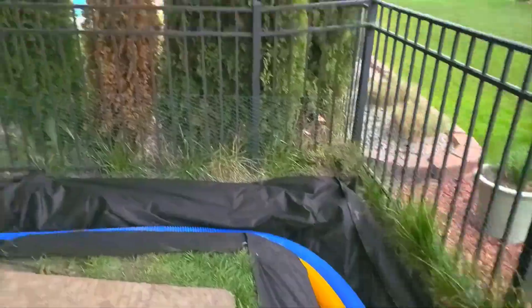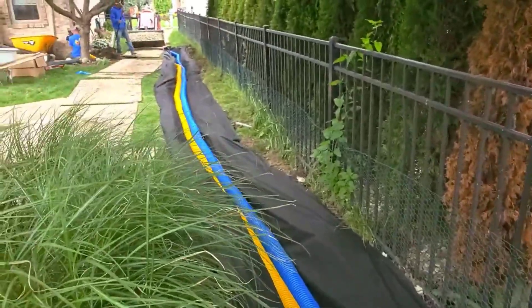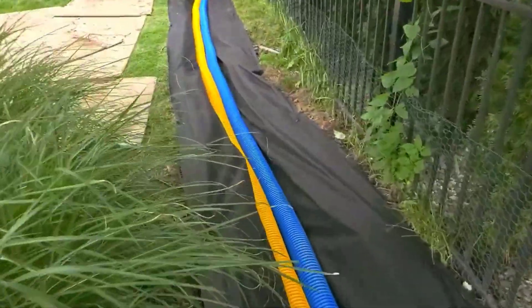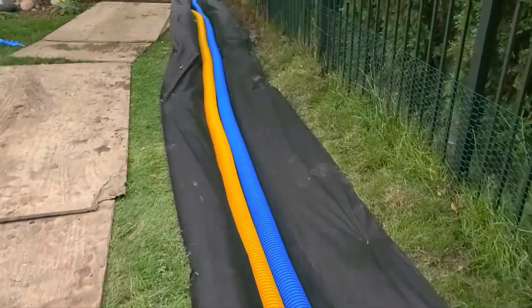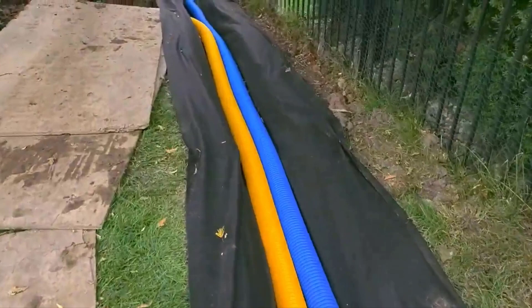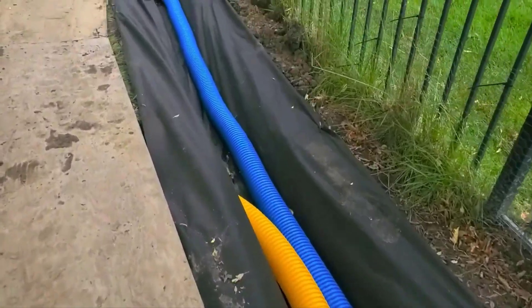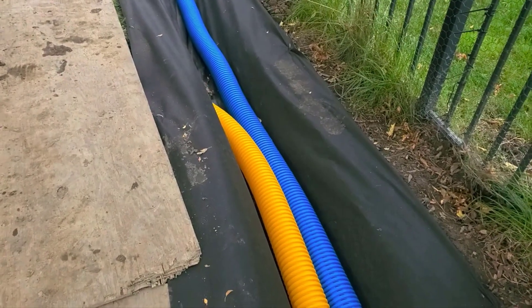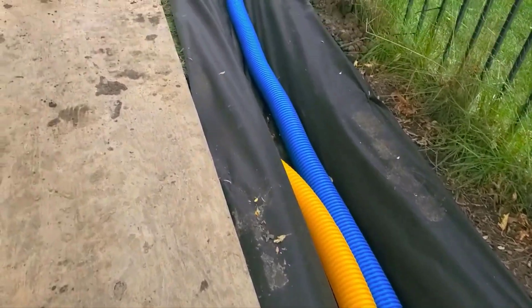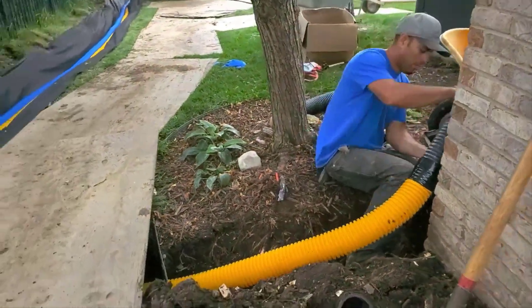This is an acting reservoir if it did back up, but I just don't see that happening. We're getting water off that pool deck and a lot of water from next door they end up inheriting. Here we're going to do a cover drain — an open french drain across the back, cover french drain down the sides because the dogs don't run up and down the sides as much. We're going to tie in all the downspouts with virgin material that way. You don't have to worry about animals digging it up or chewing on it — for whatever reason, varmints and rodents like that recycled material made out of restaurant and food containers.